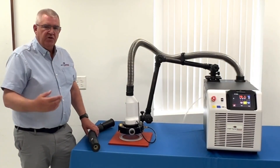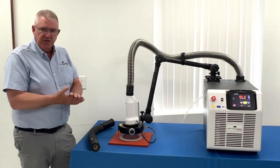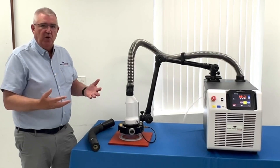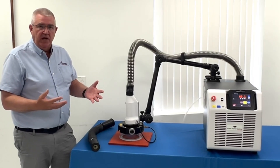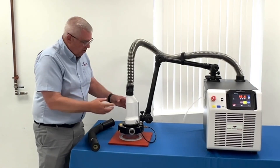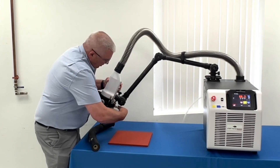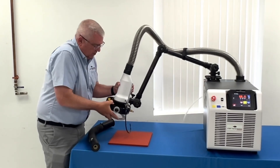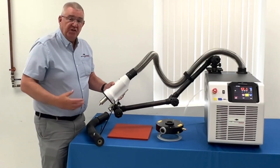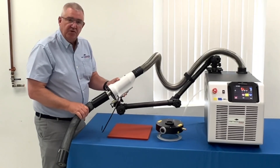Because of the performance of this VT28 — minus 28 to 225°C, 14 CFM — it opens up the possibility of applications outside of pure semiconductor test. These thermal caps are very easily removable; I can just take them off and slide the cap off the nozzle. Once the cap is removed, you can easily take a standard flex hose, connect it to the thermal head, and have it feed some form of an enclosure.